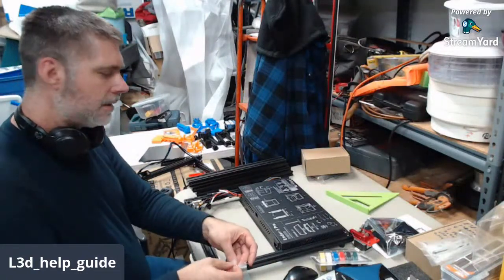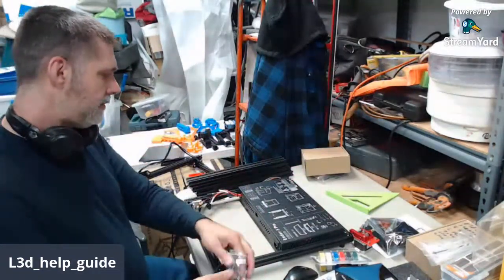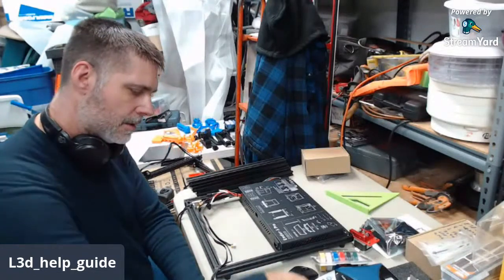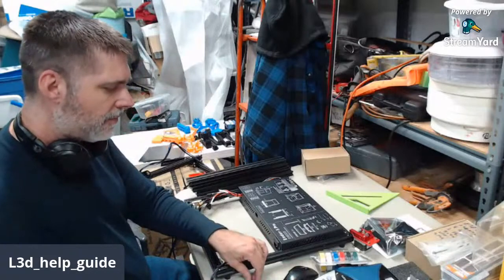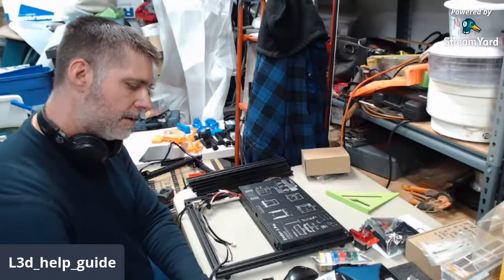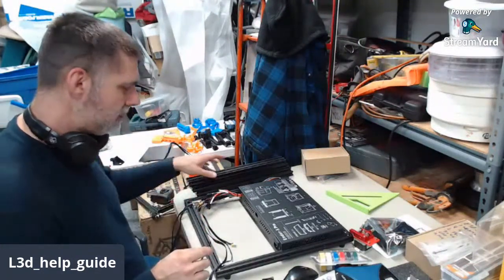Oh, and not that it's a huge thing, but even on the top of the lid of the control box, or the PSU box, whatever you want to call it, there are actual other instructions to help with the assembly of these things. The biggest thing is I'm not going to over tighten anything as I get it fully assembled. I will check it for square in a couple directions and then just slowly tighten everything a little bit at a time so that I don't knock anything out of adjustment.